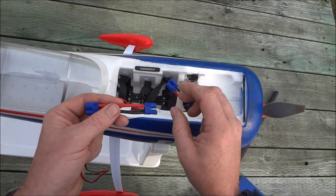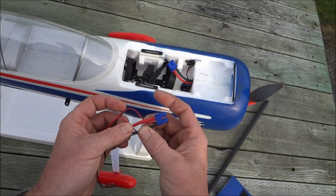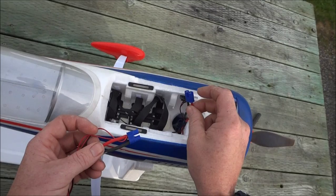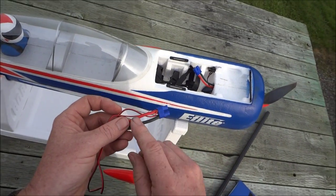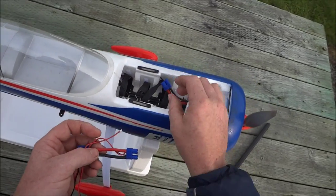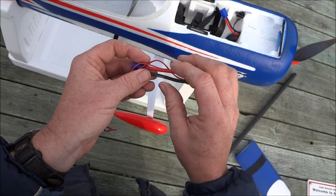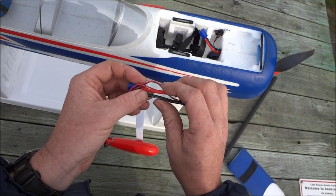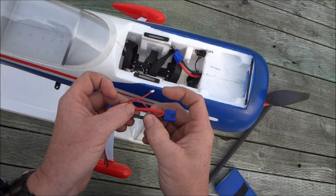So you have one end that goes into the ESC and one that goes into the battery. Then I used 12 gauge wire, which is the size of wire I have for my ESC and battery. You want to stay with the same size wire, because if you go with something smaller you risk overheating that wire due to the current rating, and you risk causing damage to your plane and possibly a fire.